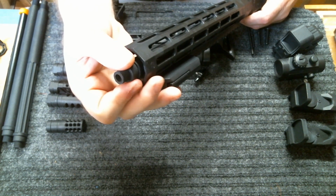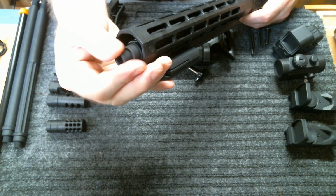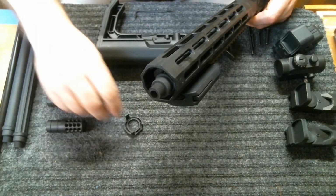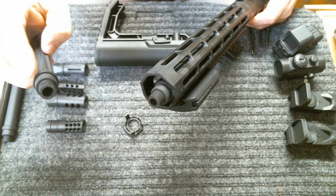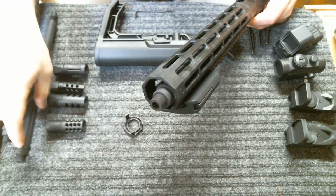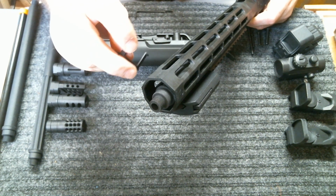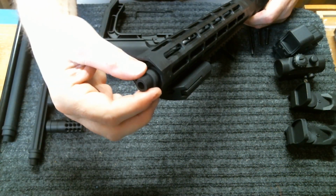And you can see that barrel's not sitting center currently. Once you get it close, and you might be able to do this by hand, what's got to happen is that cap has got to ride on that surface. So the idea is that surface prevents the cap from sliding down into the handguard, and these feet hold it from falling out. They lock in here. So you got to get that down far enough.